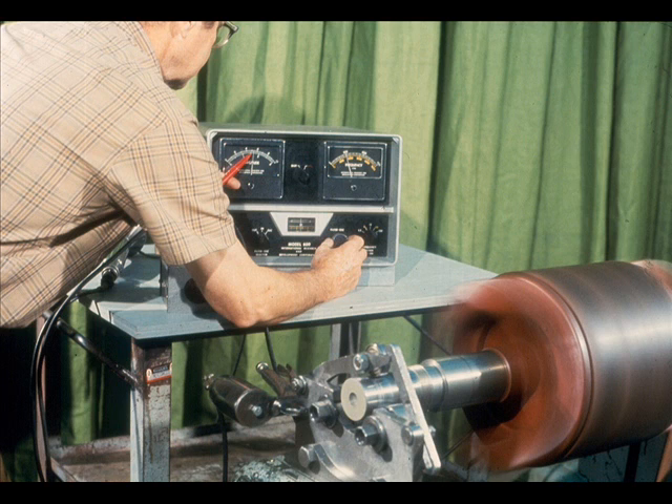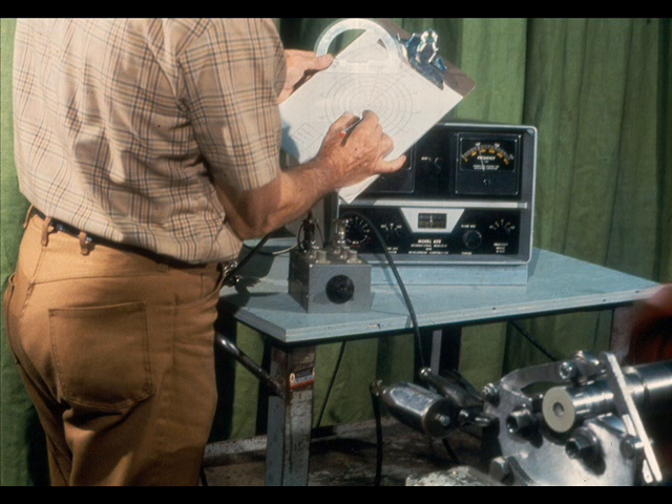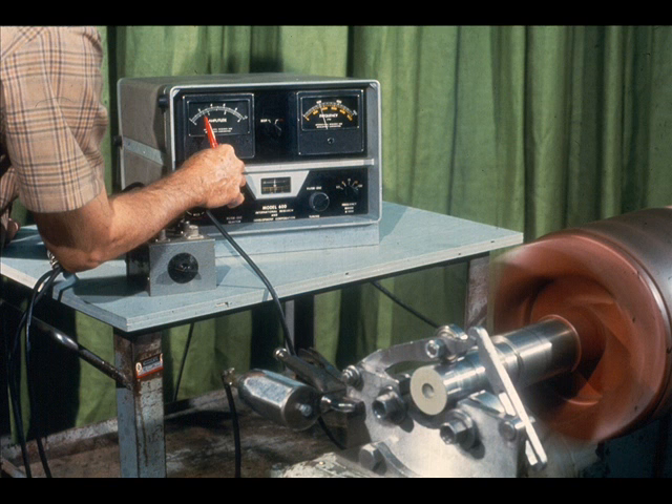Next, turn the filter back in on your analyzer and determine the frequency at which the rotor is turning. As you may recall, this may be done with the needle on the amplitude meter, as being pointed out here, or by using the strobe and the oscillator to freeze the reference mark. From this point on, you simply balance this plane of the rotor using the same methods you were shown for single-plane balancing. You may not be able to eliminate as much of the unbalance as would be expected. Remember, though, that much of the remaining vibration may be generated through cross-effect from the other end of the rotor.